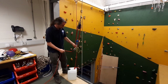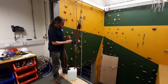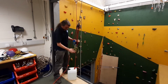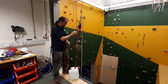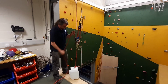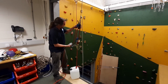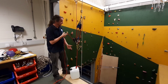And that's about it. So pulleys bend force around. If you create a system where those forces add up and then attach to another line that's attached to the load, we can increase mechanical advantage. So I can pull up 3 times as hard as I'm just pulling, or on this one I can pull up 5 times as much as I'm just pulling. But I have to pull 5 times as far, or 3 times as far, from just pulling that. So do you need to know this? Yes, it's a good idea if you know the 5-to-1, because if you're a bit short-staffed, it's really easy to do.